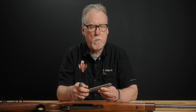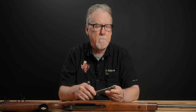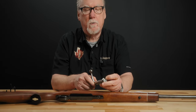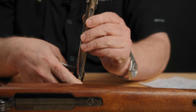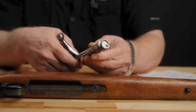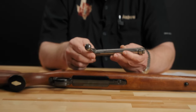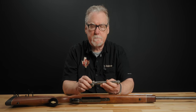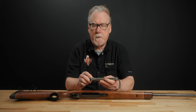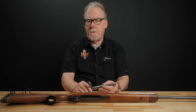Another unique feature about the BSA guns is the way they did the extractor. The Royal guns had a Mauser-style extractor with a long claw and collar, like a Mauser 98. But on this rifle, we have an extractor as part of the bolt face, held in place by a spring-loaded plunger. We also have a typical plunger-style ejector. It's a pretty robust system — probably superior to the Remington 700-style clipped-in bolt face extractor. It's a really robust action, fully capable in this gun's chambering of 7mm Magnum, and they made them all the way up through .458 Win Mag. There's no reason to be worried about action strength on the BSA guns — they're all forged steel and very high quality.